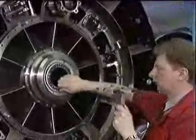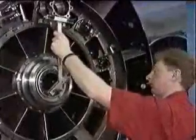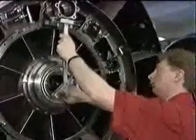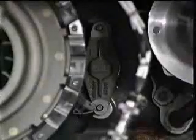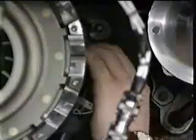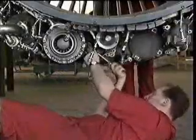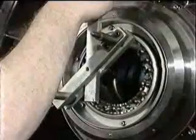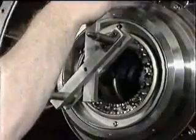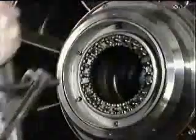This time, turn the HP compressor stub shaft to align the curvic location dowels with the alignment plate holes. Here, the stub shaft is rotated by simple direct hands-on force. But another method, if necessary, is to turn the shaft through the gearbox hand turning point between the dedicated alternator and the starter motor on the gearbox front face. This method is particularly useful when the accessory load on the gearbox is quite high. Now, the module can be refitted without causing damage to the curvic coupling.